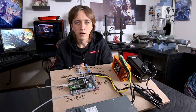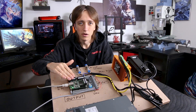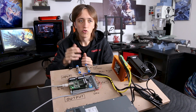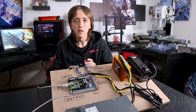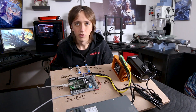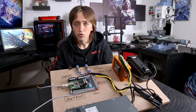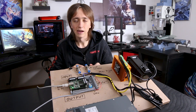It's obvious that you can't just plug your stepper motors into the USB port on your computer — for one, your computer can't supply anywhere near enough power, and secondly the signals coming out of your USB port don't really work with stepper motors that well. So the first thing you're gonna need is a control board. What I'm using here is an Ethernet Smooth Stepper. The way it used to be is that you connected your CNC machine to the parallel port of your computer, just like you would connect a printer, and your computer would actually be the control board itself, sending signals directly to the motor drivers — which means it is very cheap and easy to build electronics.